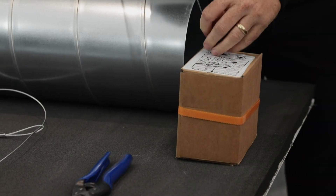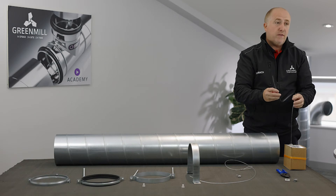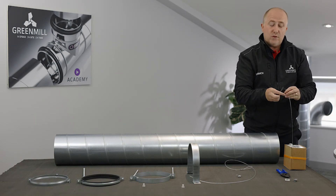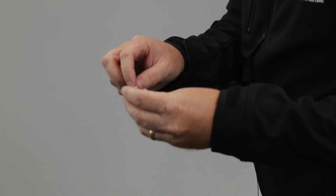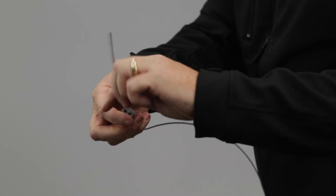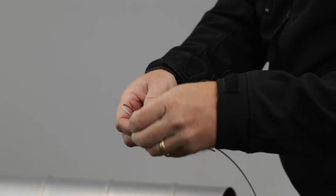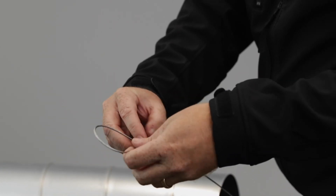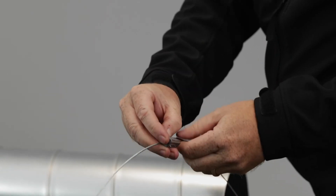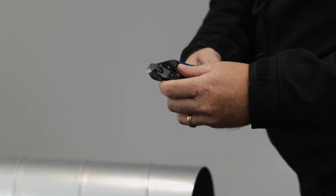The last one is the wire rope system, which comes in two sizes and two weight ratings: a number 10, which is up to 50 kg, and a number 20, which is up to 120 kg, with clutches to suit each size in packs of 10. Feed it in one side to create your loop and out the other, then push and pull to level whatever you're fitting. It has a spring release — push that way — and you can use wire cutters to trim it before or after fitting.